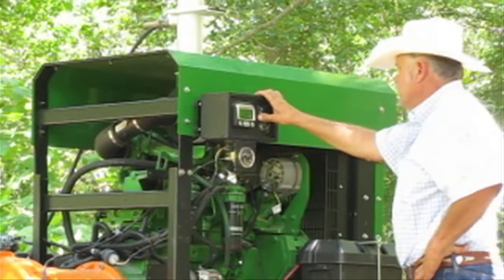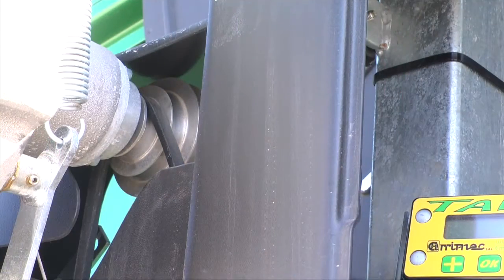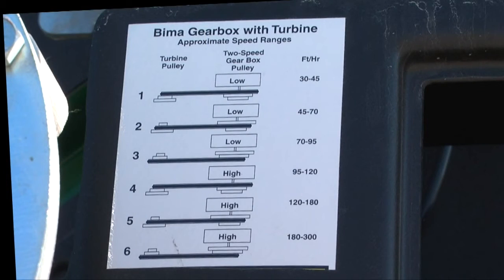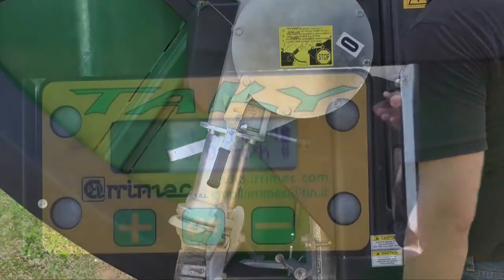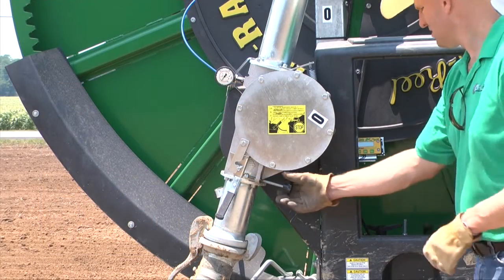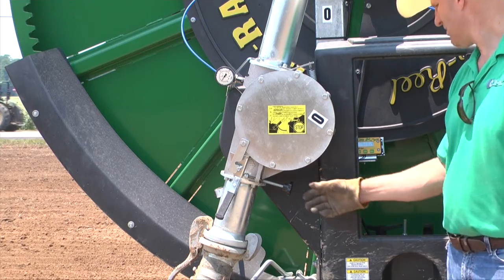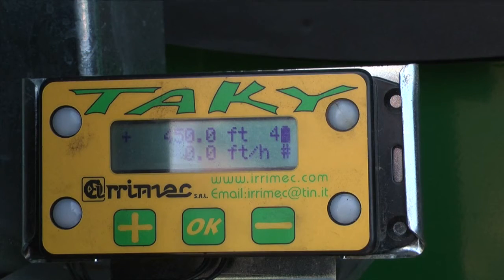Make certain the turbine is not engaged and then turn on your pump. After all the air is purged from the system and the sprinkler is operating smoothly, select the appropriate turbine pulley. Refer to the turbine drive speed range decal located on your machine. Engage the turbine and adjust the speed control knob. The travel speed indicator, otherwise known as the TACI, displays the ground speed of the sprinkler cart, the amount of hose pulled off the machine, and the layers of tube left on the spool. The speed is shown in feet per hour. Refer to the TACI screen while turning the control knob until your desired speed is achieved. For more information on the travel speed indicator, refer to the TACI section in your printed manual.